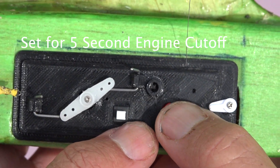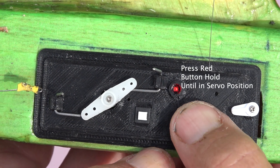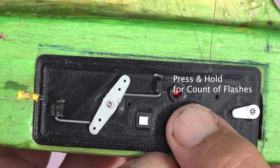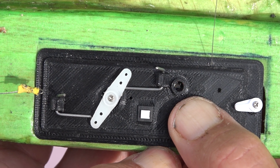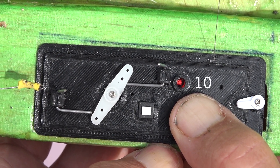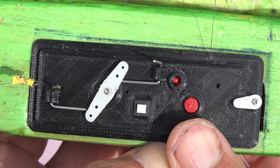With the power button off, press and hold the red button, then turn on the power — it flashes really fast. Release it and it will flash moderately fast. Press again and the servo will move to the first position. You'll be releasing that button just after the arm moves past the wire for the engine cutoff. Press and hold again until you see the number of flashes you need for the engine run. When you release, it will save the settings and flash really fast indicating they're saved.